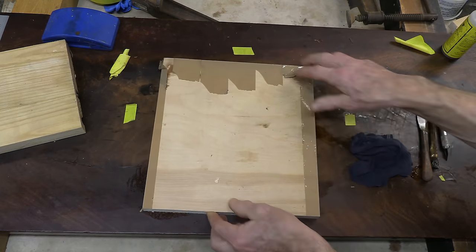I think I forgot to mention that this is a dye stain, the Van Dyke Brown dye stain, Mohawk, that I was using before. Thinned out a lot. You would call it a spirit stain, as opposed to an oil stain. It's very difficult to see what you're doing. You're not seeing this, it flashes off, it looks different. Don't want to get it too dark.